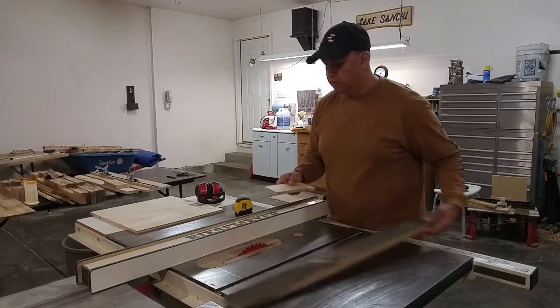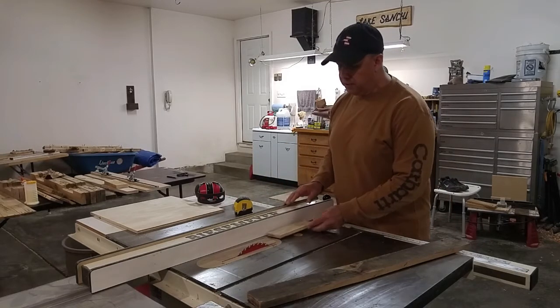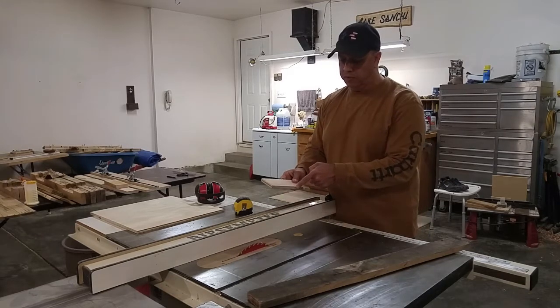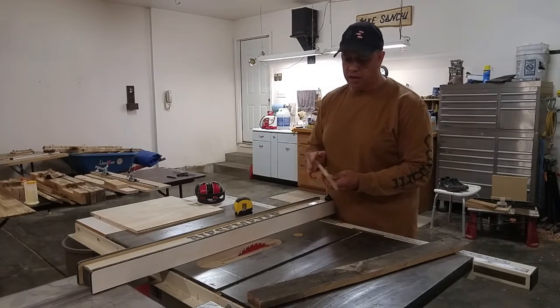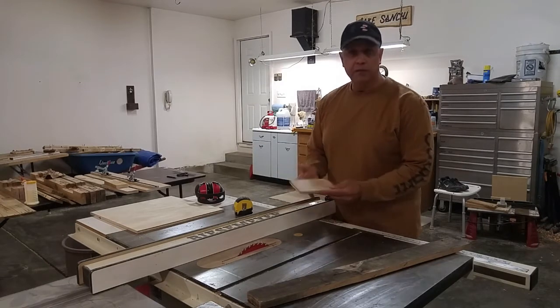Basically what I'm going to do is cut out the plywood — I have some scrap right here — then run this along the table saw just to cut a little bit of a groove, turn it over, put another little notch right there, and then finish it off with a handsaw. Then sand this down on the top for a curve for my palm, and then it's done.